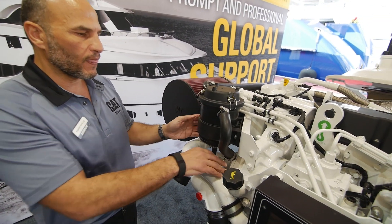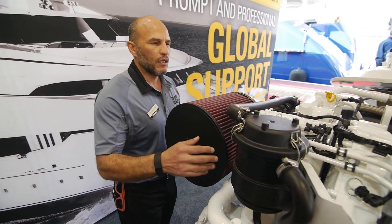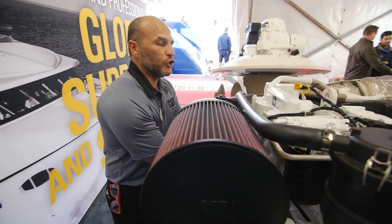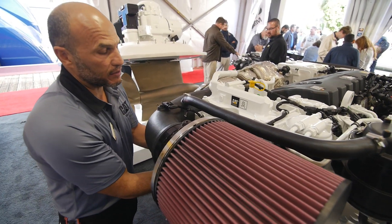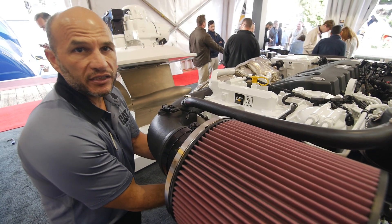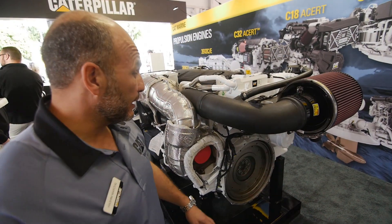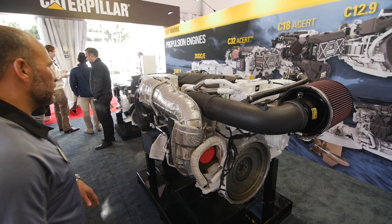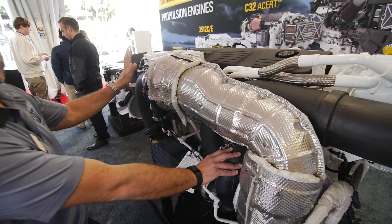The engine features a dual CCV system: an inter-CCV and an outer CCV. It also comes with one primary fuel cartridge type filter and two lube oil cartridge filters. The cartridge filters only require about one inch of removal space — drain the oil first, then you can remove the full unit, making for easy access. The C12.9 comes with a SAE-1 metric flywheel housing. Here in this area you will see the series turbochargers: the low-pressure turbocharger and the high-pressure turbocharger.